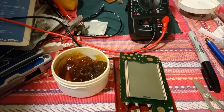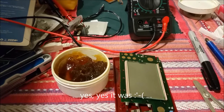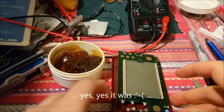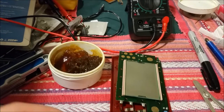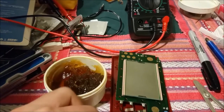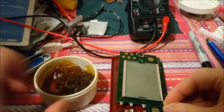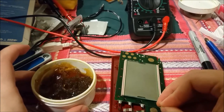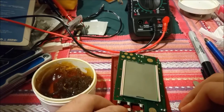I just got a weird error about my recording failing — hopefully the first part wasn't ruined. So yeah, I already pre-stripped a tiny little piece of wire. This isn't very high current or anything, so I'm just going to use a tiny 30-gauge wire — that should be good enough. I don't really have a brush or anything, so I'll just grab a little bit of flux. Since these are very old solder pads, it might be kind of hard to get solder to stick, so I'm just rubbing a tiny bit of flux on the pads I want to solder.